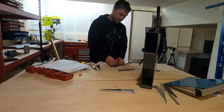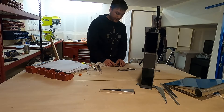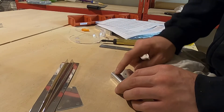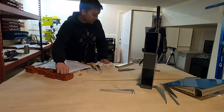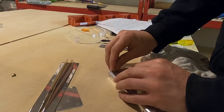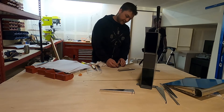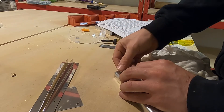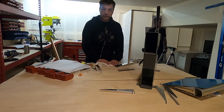There are a few different types of rivets. The first is what's called a universal type rivet — this is probably what you've seen or are familiar with; it has a domed head and comes in all sizes. With that, we simply set that rivet, squish it on this end, and we're done. Because we are building an aircraft, we often use a countersunk rivet, which has a flat head. You can see it sticks up above and isn't completely flush unless we do what's called dimpling. Dimpling puts a dimple in both surfaces so that when the rivet sits in there, it'll sit flush, giving us a smooth aerodynamic surface.